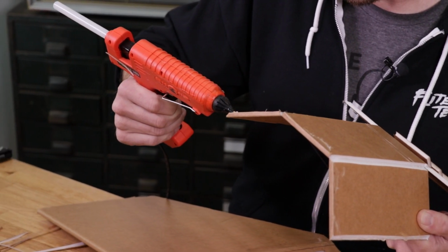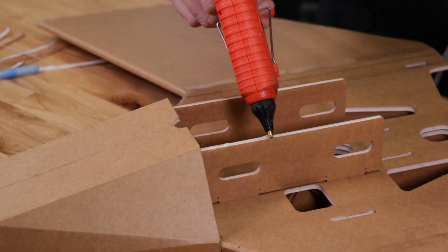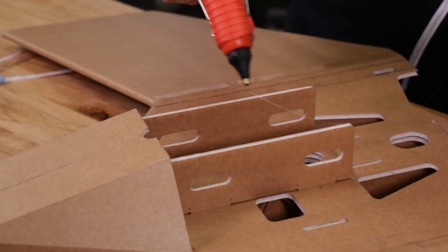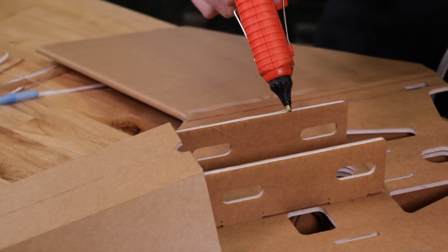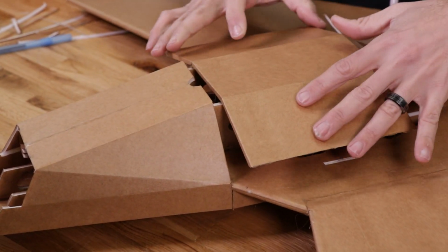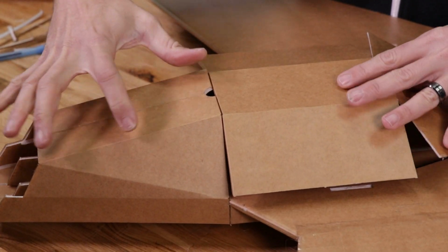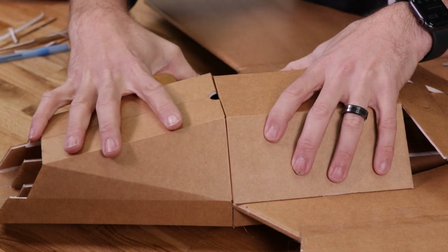and there's two. And then finally, we're gonna start about a 1/2 inch from the back, put a nice healthy bead of glue right on the bottom piece here. No need to rush, same motion that we did before. We're gonna slide this all the way up against the front nose, center it up, and then press it down into place.